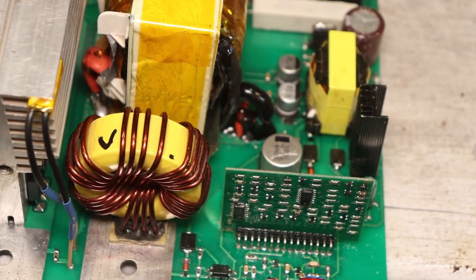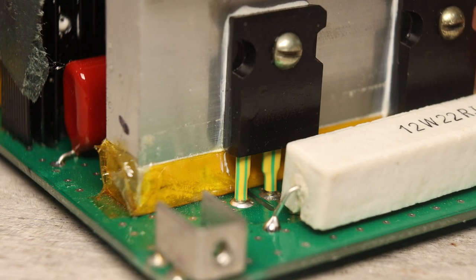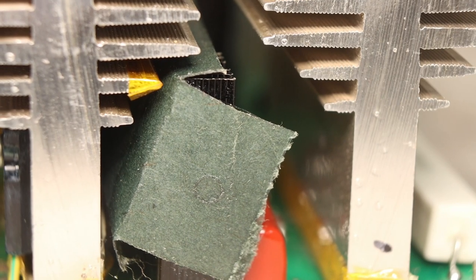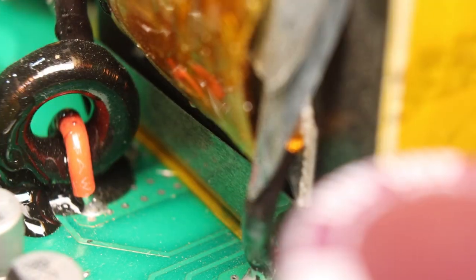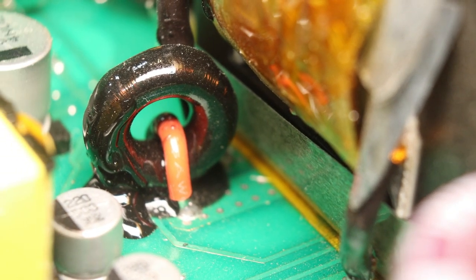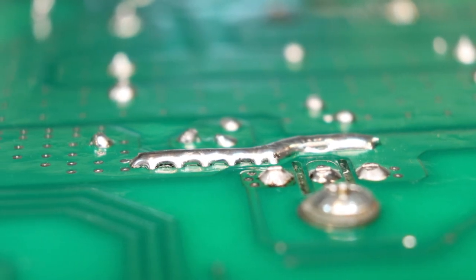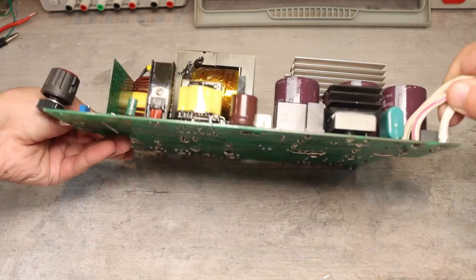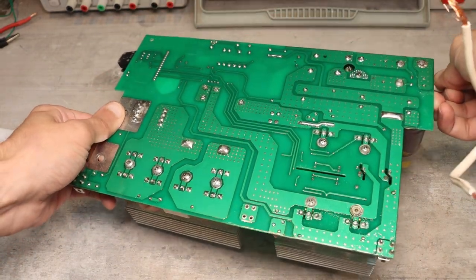I've been re-insured everywhere — the pins of the power transistors are each in a ring. Everything that is needed is insulated with Kapton and other insulating material. Components which are under vibration are glued, high current tracks reinforced and tinned. In the end, the board was coated on both sides with a triple layer of a special protective varnish for printed circuit boards.